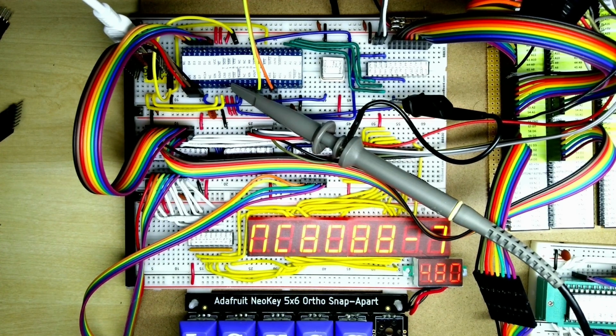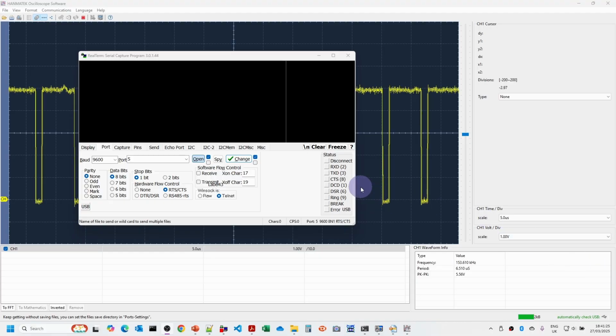Okay, so what we need to do is first of all send the extra segment to be F000. This is the top area where the EEPROM is, and then we're just going to do save 9000, and the finish address is going to be 9010. So we'll just switch back to the terminal, and if I now press the 0, we can see we've actually got something coming up here.